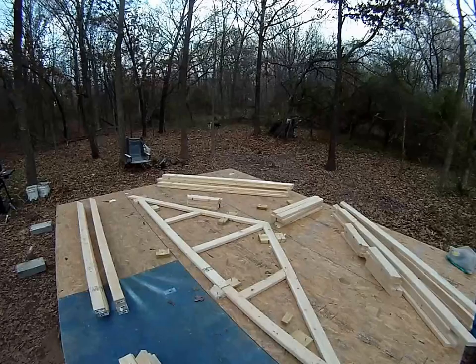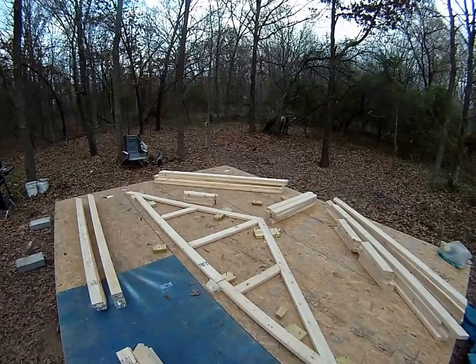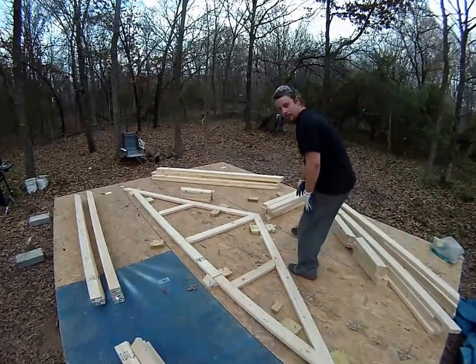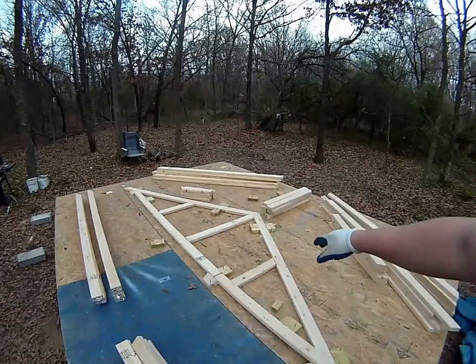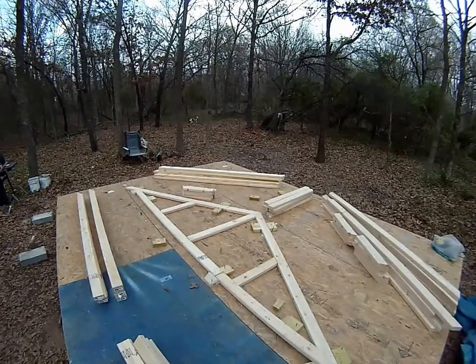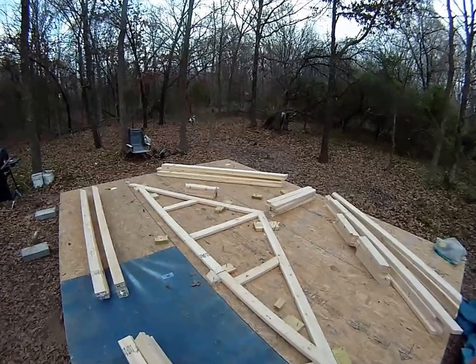We got everything cut and ready and stacked, and got our 100% maximum production facility set up right here. We just took and nailed down some scraps of wood wherever all the top and bottom chords go, and then we don't have the web members blocked out, but they'll pretty much just slide in there tight. So we're just gonna go through here and screw on some gussets.